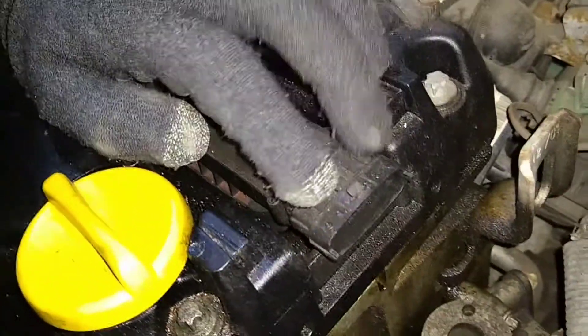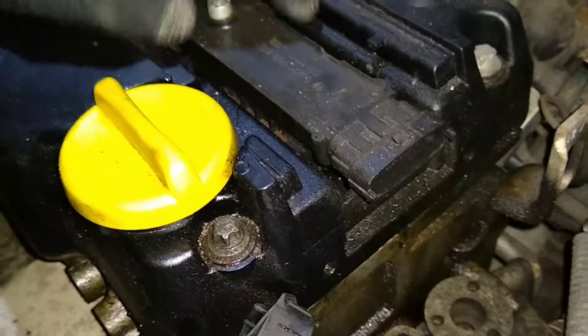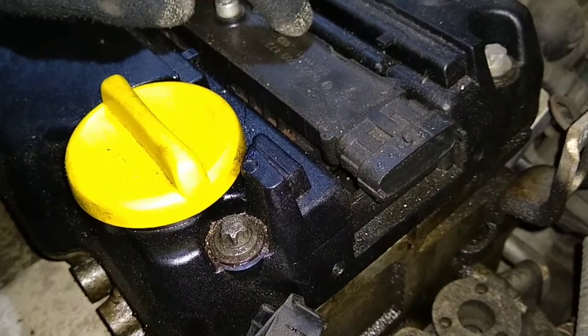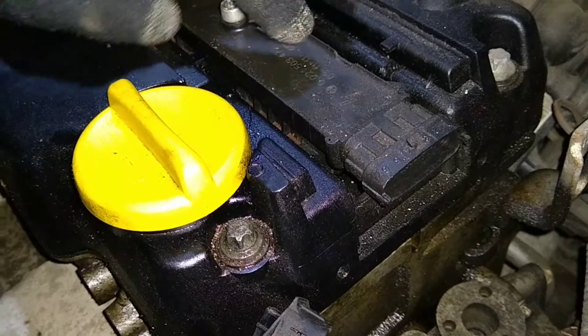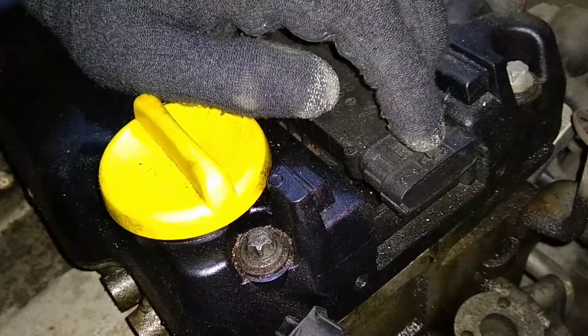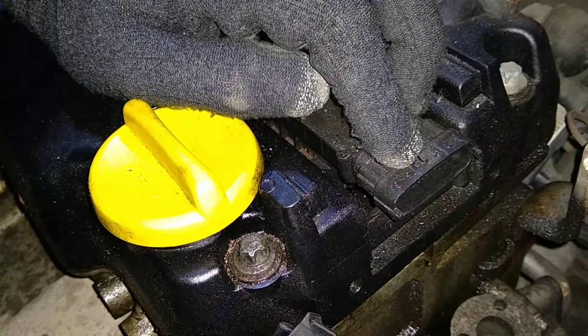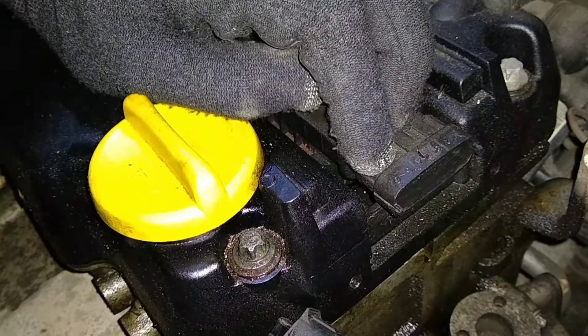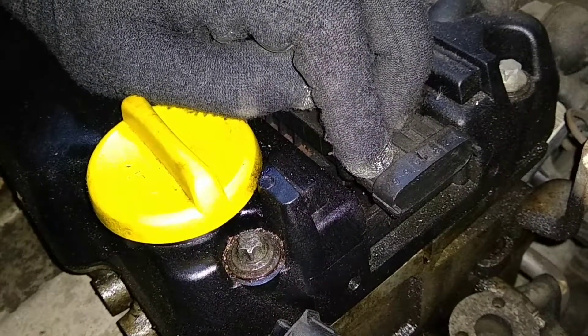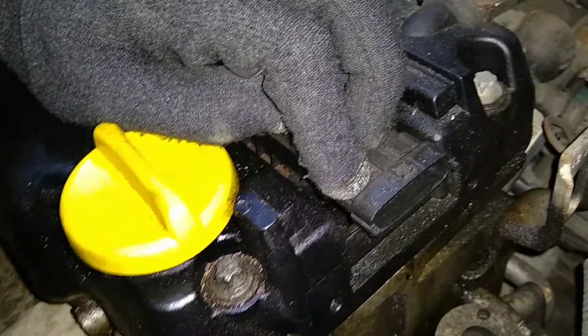You'd need to know the pin out, which someone online has probably got, or you could guess and work it out by doing various tests. You could continuity test between here and the chassis, although you'd have to watch out for back-feeding some voltage somewhere you don't want. We could measure the resistance of the primary - that's something I should do.